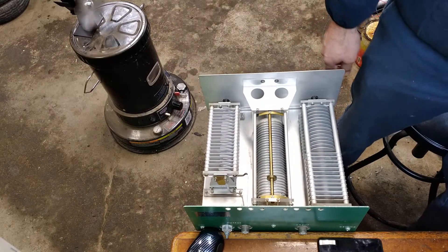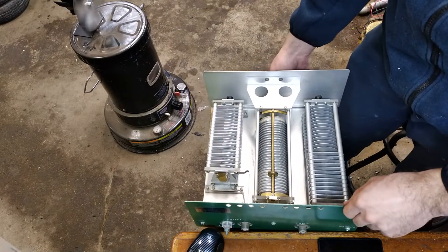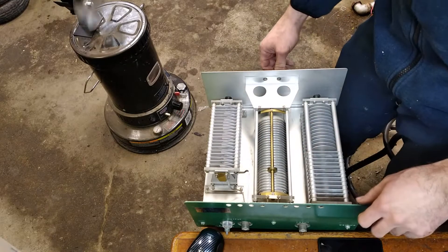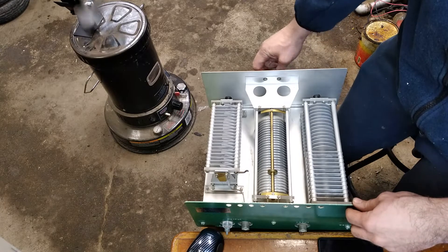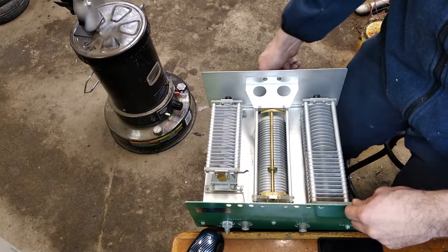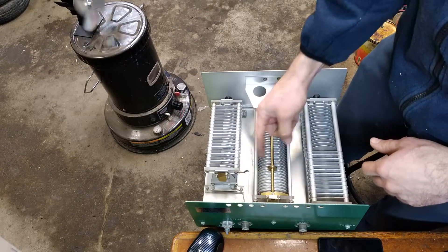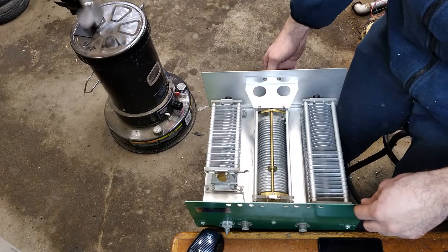Interesting — my handheld's going off. In the center we've also got our roller inductor. This is pretty unique to me because we're actually moving the inductor rather than moving the roller. I had a Vectronics — I've got a video on the channel on that Vectronics — and that actually moved the roller inside of the inductor, and it was really poor.